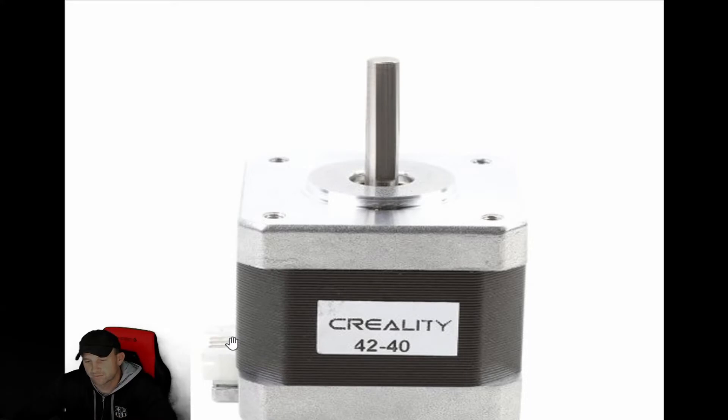When removing these, make sure you see the electrical connection — there's a tab in there. Make sure you pull that tab off. If you need a tool, use a flat-head screwdriver and just kind of push it off, but don't yank on it. This is one question we had — some of these prongs broke off because people were too aggressive with it. With any small electronics, always try to be very delicate when taking them off.